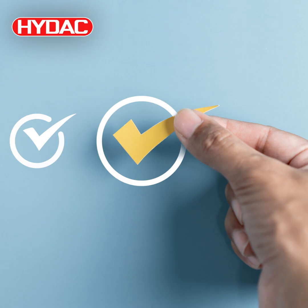There will be a part two on this topic. One final point: AS/NZS 61439 is a self-assessed verification, so it's on you as the designer and panel builder to assess yourself. When you issue a certificate of compliance at the end of the job, it's you who issues it — there's no government authority that checks it. You have to compile your own evidence, do your own tests, and put your name on that legal document swearing it's compliant. It's a promise from supplier to customer. We're more than happy to answer questions or give advice to anybody still finding their way — Australia is a nation of mates and we're all here to help.